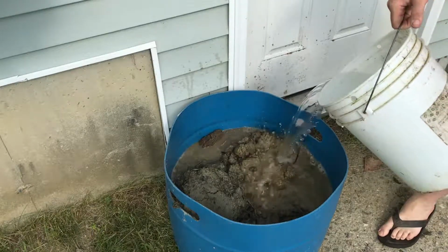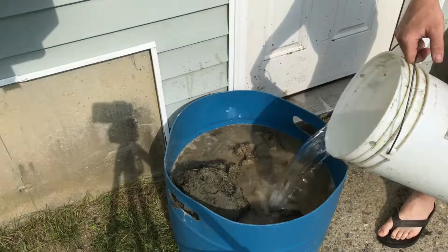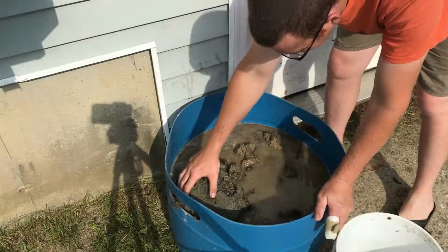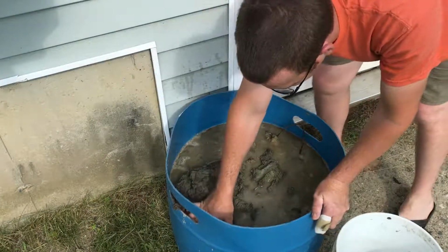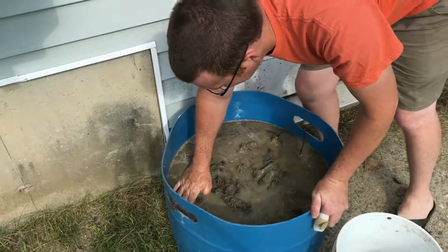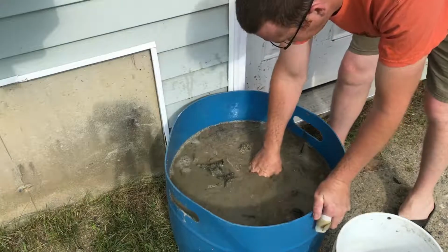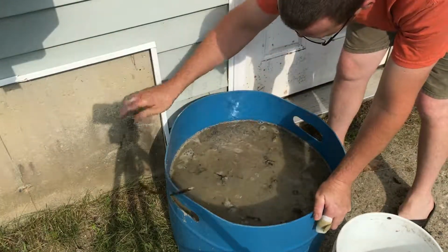The next step to our oven is to build the dense layer of earth that will sit beneath the hearth floor and act as an insulated heat sink. It will be made from a clay and wood shaving slurry encasing glass bottles, the method favored by Denzer. Following the recommendations, I'm soaking this clay for a few days to ensure it has the right consistency for mixing with the wood shavings, and then building that bottom layer.